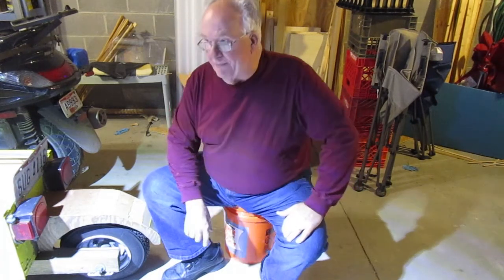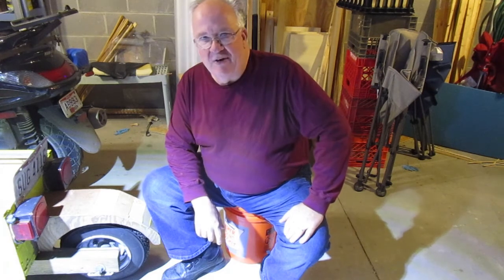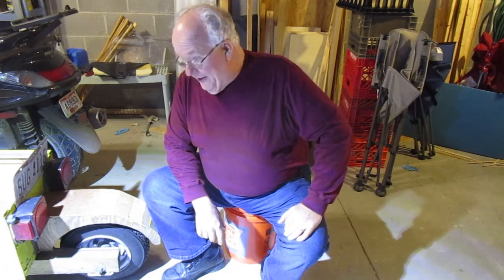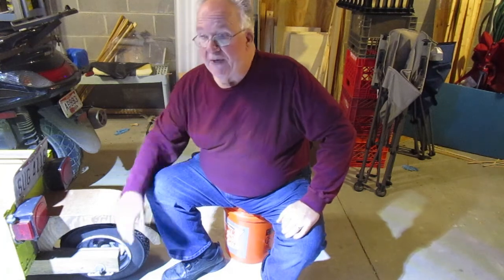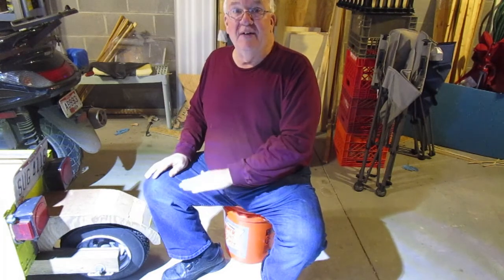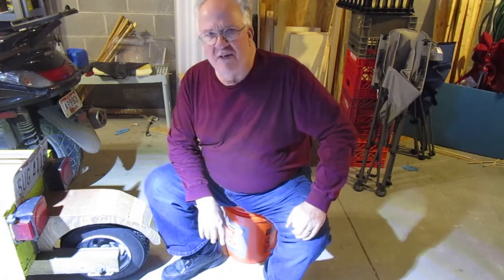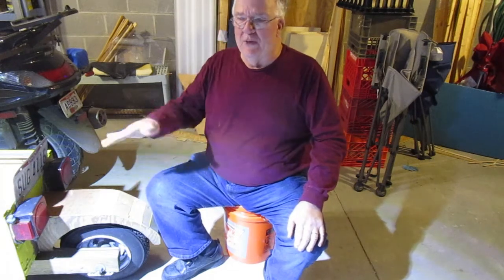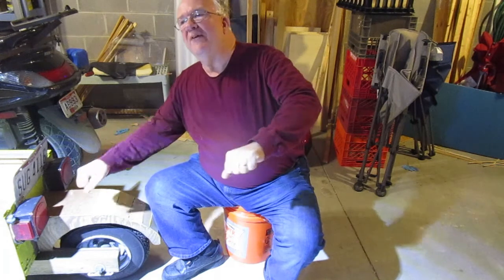So that's how I wound up with that particular combination. The problem I had with the trailer tire that came on it is the quality control is absolutely horrendous. The wheel would run true, which means the bead would run true, but there was variation in diameter so that it would hop lightly going down the road, and there was also the tread wobbling back and forth. That didn't cause any significant issues going straight, but going around the corner with this wheel going wiggle wiggle squiggle, you would go hop hop hop hop, and you're doing this all the way around a curve.